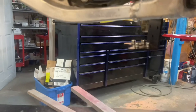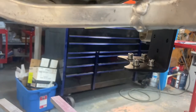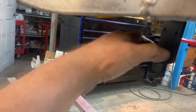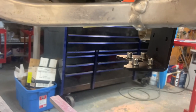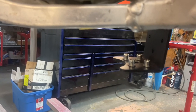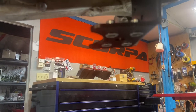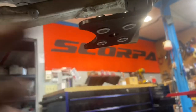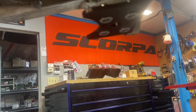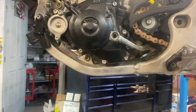Yes, I'm nervous about that. The other thing I'm going to do at the same time is I'm actually going to take this guy off, get rid of all the rivet nuts, and one of these blocks is going to get welded on top and then get threaded. That way I'm not worried about ever losing it. The only downside with rivet nuts is that you have that washer kind of thing sticking out there, which is how the rivet nut holds — there's no way around it, but it's gotta go. So that's about it for tonight. Thank you so much for watching, and we shall see you next time.